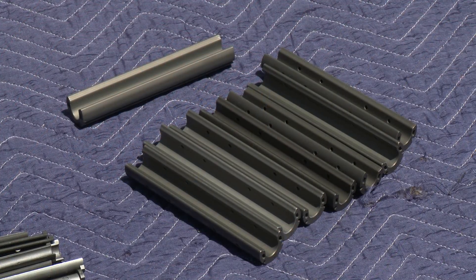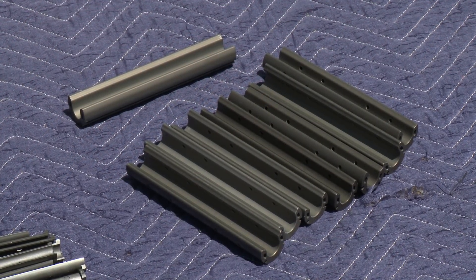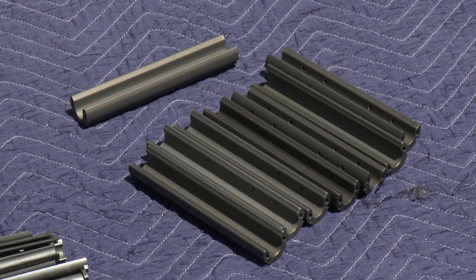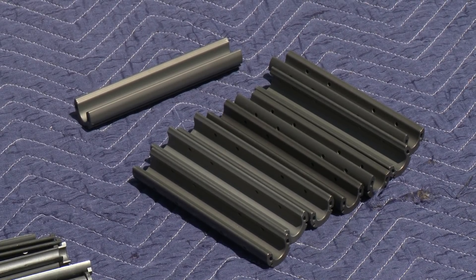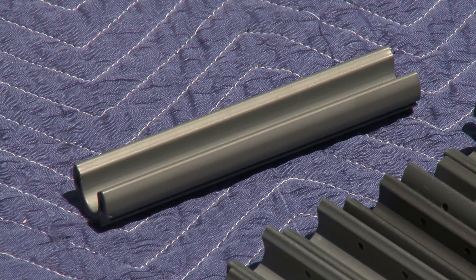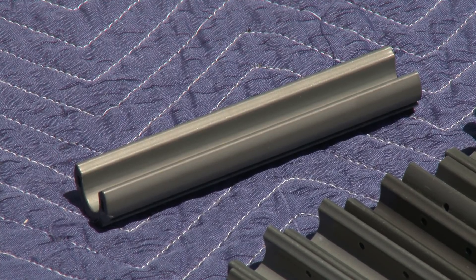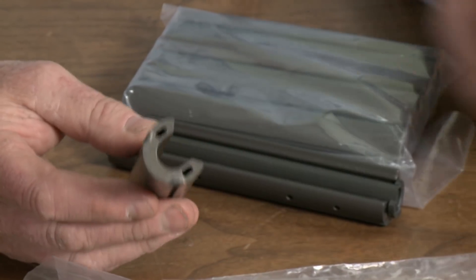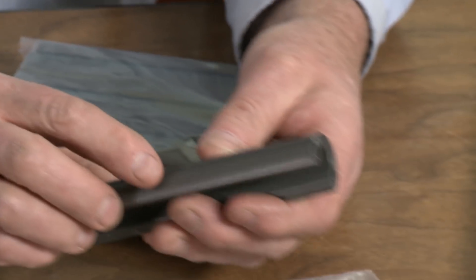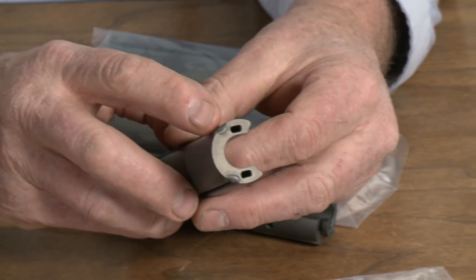There are several plastic bags in the kit. One contains the extrusion joints — connectors that hold the full-length foils together and are riveted to the foils. There's one special joint that is not riveted in; it has a welded tip on one end. Hold that one aside — it's the upper joint used after you cut the extrusions to length on the system.